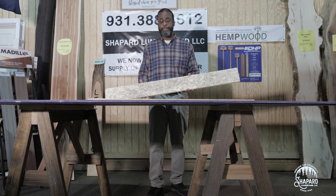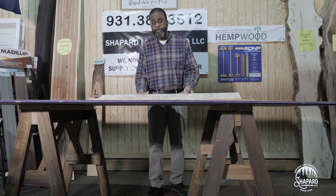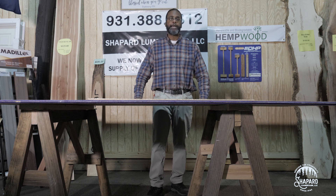I want to slow up here because I've seen a lot of assumptions on various forms and even on Facebook — I don't want false information getting out there. This is NOT OSB. OSB stands for Oriented Strand Board. OSB is a flake-type material put in a vat, stirred together with a certain type of glue, then compressed and put out in sheets. Hemp Wood is a fiber-based product made out of hemp.